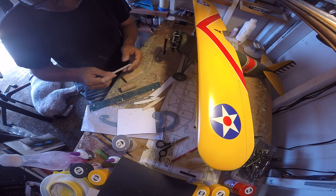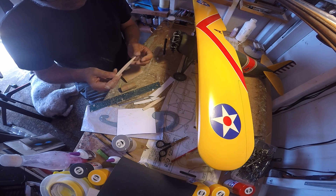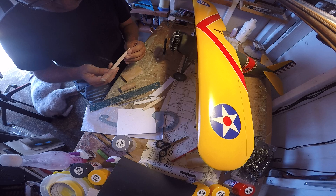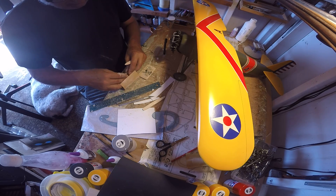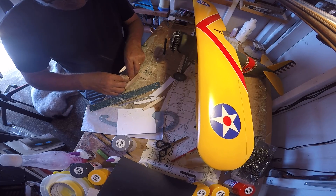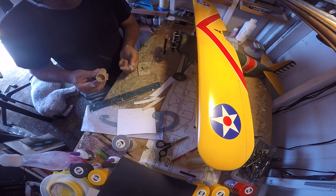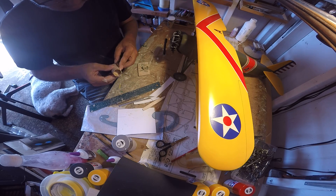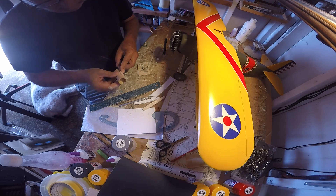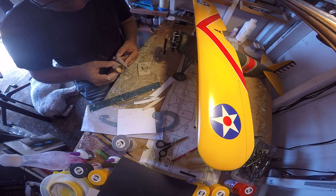This takes a while. It's one blade at a time. It's much more fun when it's a four-blade or six-blade prop, let me tell you — just multiply the fun. Let's get up under the tip. Looks like we're a little thick yet, especially on the backside here. I was concentrating more on the middle of the blade when I was doing this hollowing, so now we're going to focus a little more on the tip.